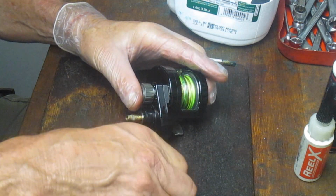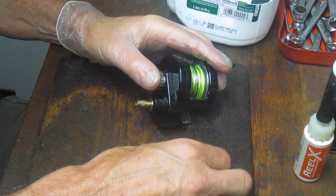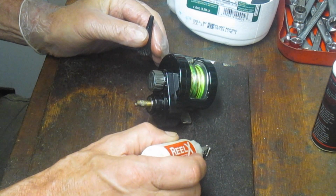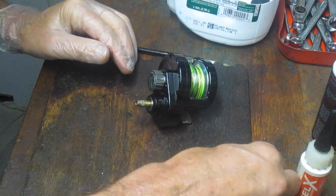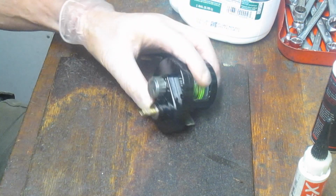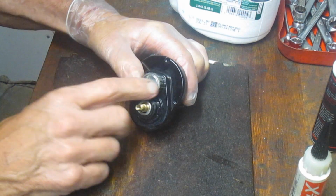So the 3 screws are the same. I like to protect those screws on the rebound. I'm going to put a drop of oil on there just to let it seep into the seams. Last thing you need is a hard or stuck case screw. And if you're using these in salt water, which is where Mark is using them, the salt tends to gravitate to those threads on the screw, and if we can avoid having a problem with that, we will. Alright, the case screws are off.